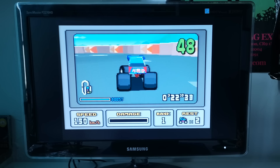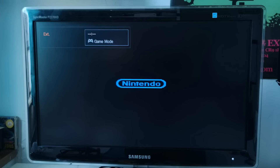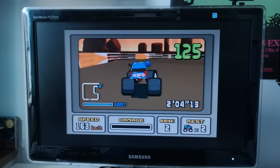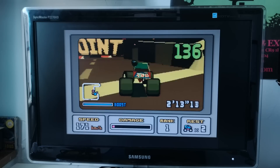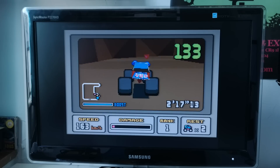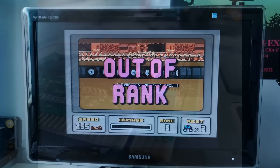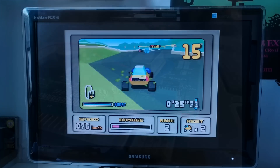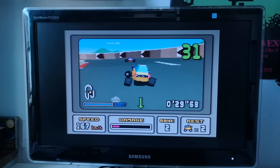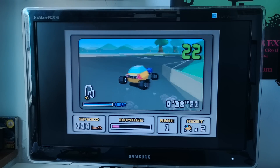It works so well, I think I'm going to go a stage further and try for 32 megahertz. Will this boot? Yes it does. Is it stable? No, it's not, sadly. It runs just long enough that I was really starting to get my hopes up — I was able to get pretty deep into the novice racing championship — but it never lasted. The improvement at 32 megahertz is pretty noticeable and it comes tantalizingly close to working, but it's just not there. I tried messing around with the wiring and connecting the output pin directly to the board, but this didn't help. It didn't make it stable.